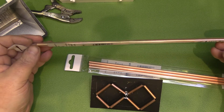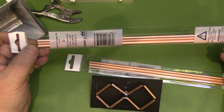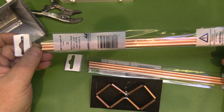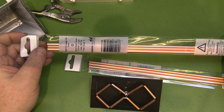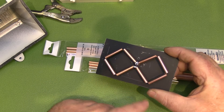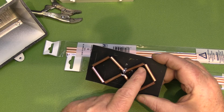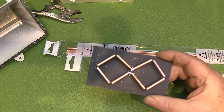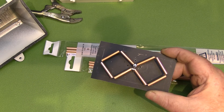The seller lists them in lots of different sizes and diameters, including imperial measurements if you still use the imperial system. It's really good quality stuff — this is copper, even though it might look a little brassy on camera. For this build I'm going to use the 4mm tubing for the main driven elements. What I do is make a small cut just enough to put a right-angle bend in. You have to be careful because you can only bend this so many times before it snaps, but it gives you a nice bi-quad with that extra bandwidth from the tube thickness.